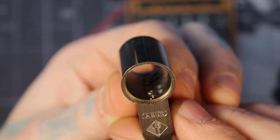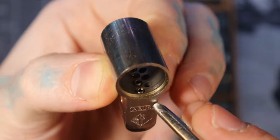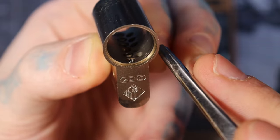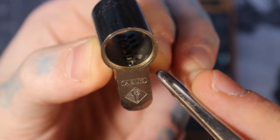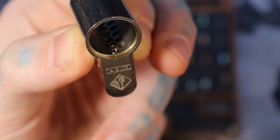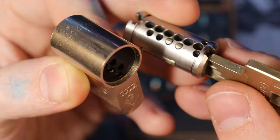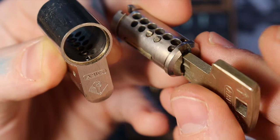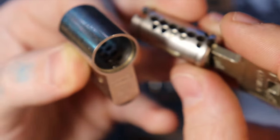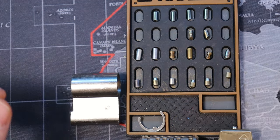So you can see in here, interestingly enough, that there are 5 holes on the right hand side there for those key restriction ball bearing pins right there, except this very first one remains empty. It is not used. You can see that on our core here. So you can see there's 5, there's 4 over here, but the first one over here is missing. So we do not populate that one when we're rekeying it, or repinning it.